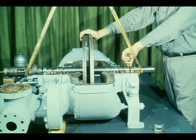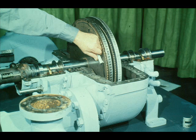Remember to lower it very carefully, paying special attention to the position of the oil rings. After the rotating assembly is in position, the workman measures the clearance between the nozzle ring and the blading of the first rotor. The clearance should be approximately one-sixteenths of an inch. Check your manufacturer's manual if you have any questions.